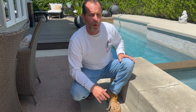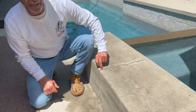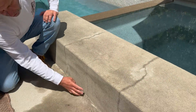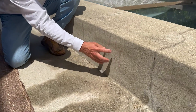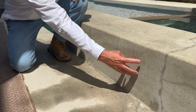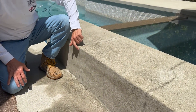So this is after we wet it — you saw the process. These areas are retaining real moisture. However, this is all just check and shrink cracking from the original pour, so there's no structural issues with this whatsoever. But you see where that moisture is really retained?